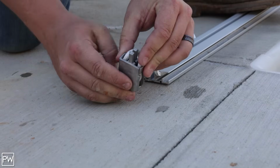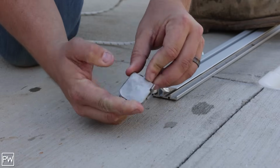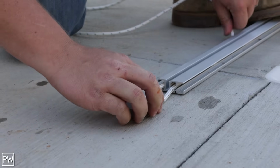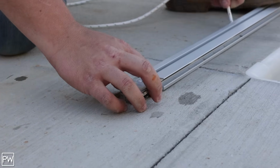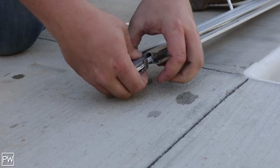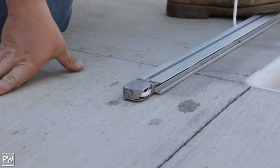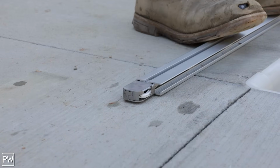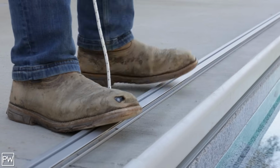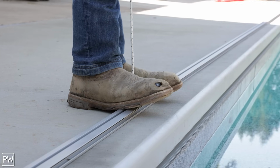So that pulley is in there and the rope's coming out the rope channels. The ropes are not supposed to be coming out the sides like this. If it is and you try to run that cover, you are gonna damage and break that rope. So we're gonna use our slack to pull this in. Get our pulley in, it's nice and snug. We're ready to repeat this process the same way going back. I'm gonna keep the rope between my feet, step forward with one foot, plant it on the track, pull with my back foot, all the way back down.